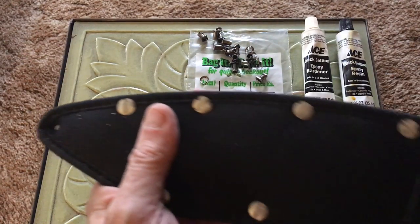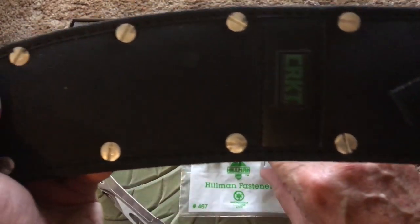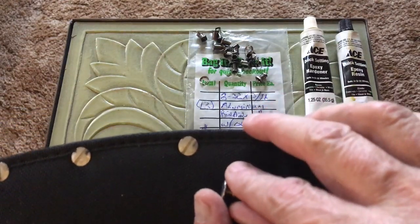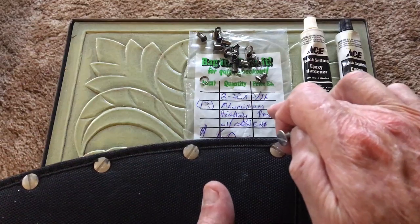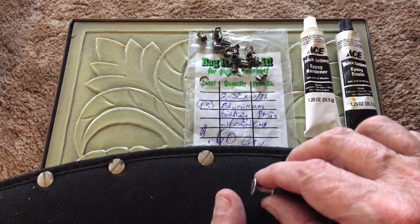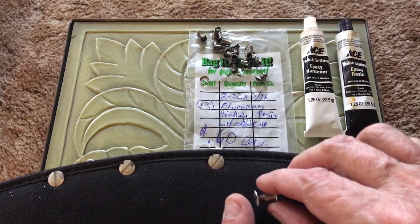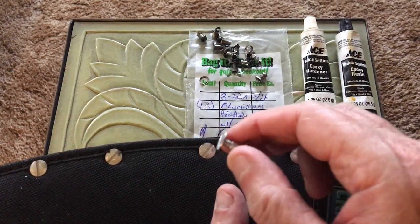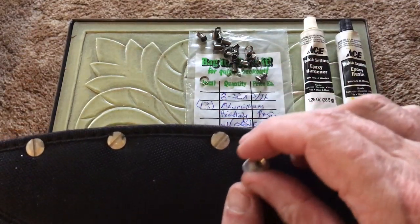How I did this — and this can apply to leather sheaths or whatever have you. You see this right here? This is what they call an aluminum binding post. These are 8/32nds times 3/16ths of an inch long aluminum binding posts with open ends. There you go — there's one side, and this is the female side right there.